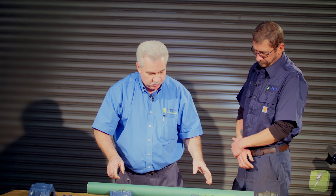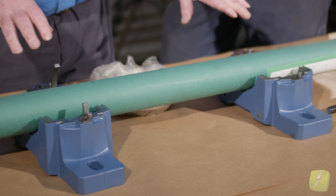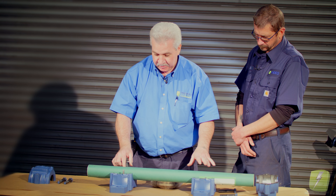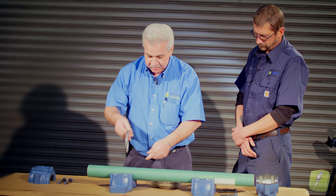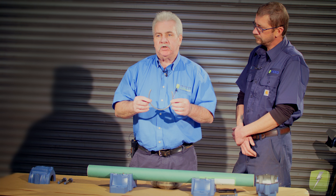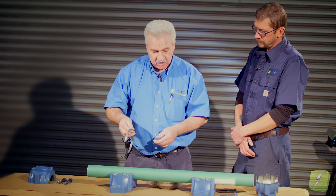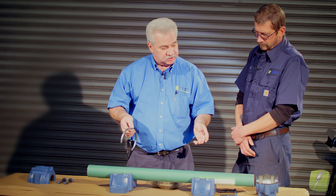Right now what we've got is two bearings that are pillow block bearings that are basically the same bearing setup, except for this is what's called the fixing ring. This is what limits the float of the bearing depending on which end you want to lock.